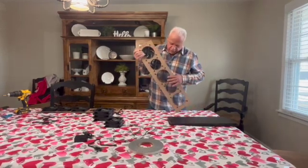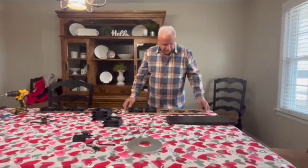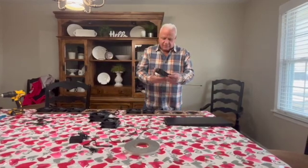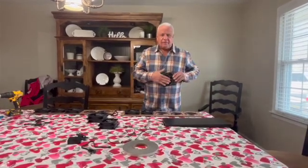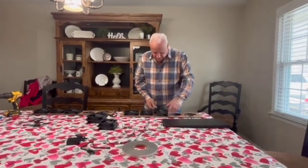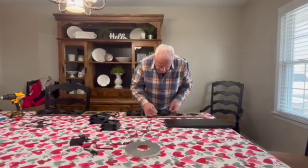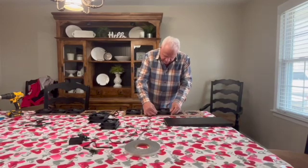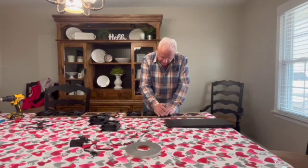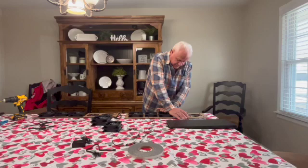We have grills already on and push pins are in the grills. Lay your side down. Fans will always go with the guard that comes built into them up against the grill. Run your cord out the side. Make sure your pins are lined up, get them barely started, and then push down with the heel of your hand on the push pins. Make sure they're seated good.